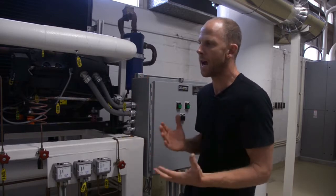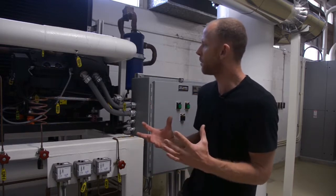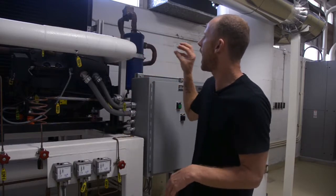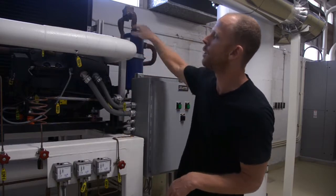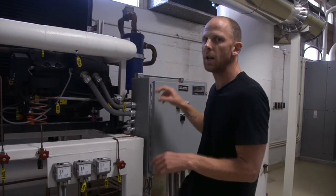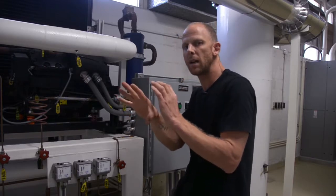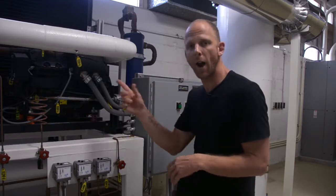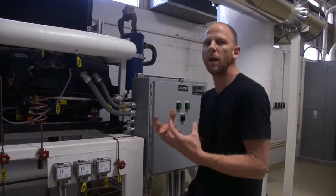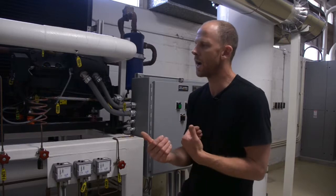All right, so that's how our temperature is regulated in this system. So again, basic components: a compressor compressing our Freon gas into high pressure gas, moving through our condenser, becoming liquefied, moving through to our metering device, which is expanding our liquid, regulating a flow of expanded liquid into our evaporator. And our evaporator is the second heat exchanger where Freon, bubbling Freon, boiling Freon, comes into thermal contact with our airstream and cools our airstream.